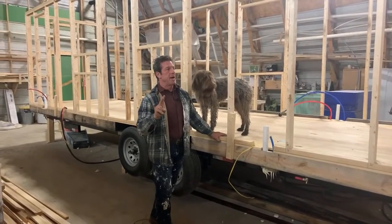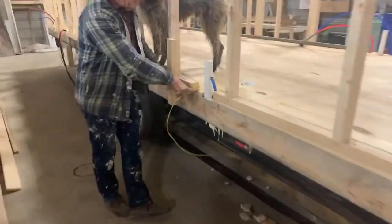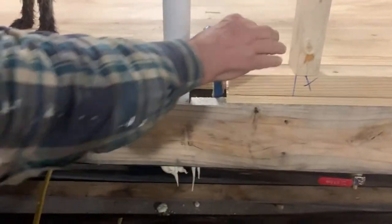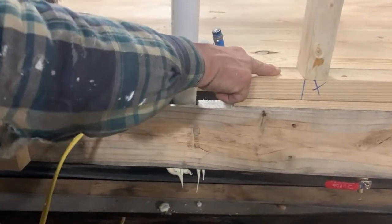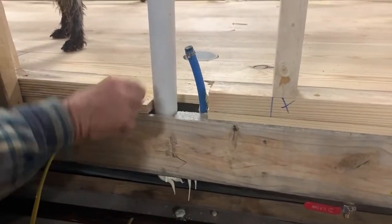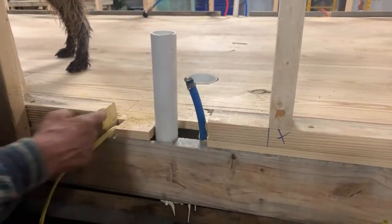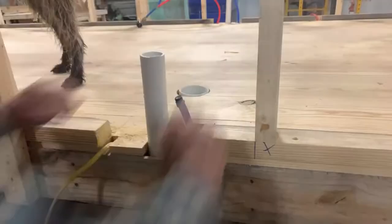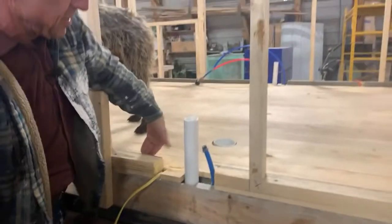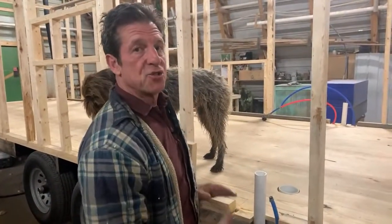There's two ways of framing a house. This subfloor that you see right here, as you can see, is underneath the 2x4 wall. It's a 2x3. We use 2x3s on here, which is perfect. As you can see, all this plumbing. If we were to drill a hole through that, it would take out the same amount. There's no support lost here. There's no walls moving. We don't have to worry about any of that. It screws straight down. Our V-groove goes over top of this, our sheeting goes over top of that. Cutting that out doesn't interfere with any of the strength on this home.